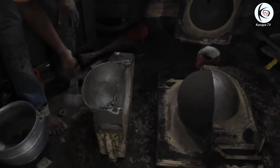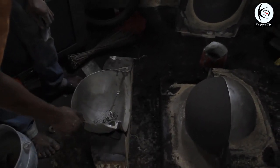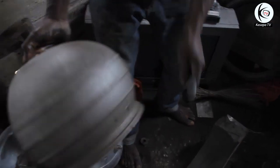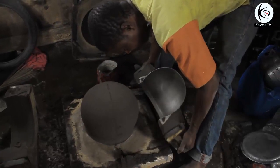The metallic part has been taken off, so the pattern has been removed and the molding is now visible. The molding detail from the metallic pattern is also seen transferred into the soil. You can see clearly that the molding on the metallic pattern is reproduced in the soil. He is taking the other side off too — we can now see the molding of the pot in the form of the soil.